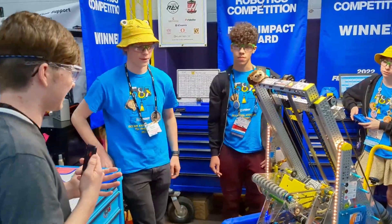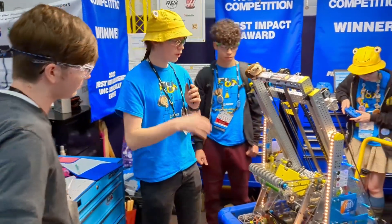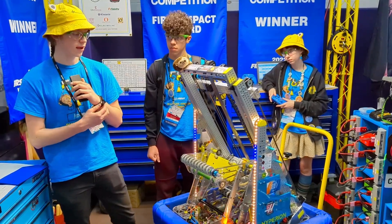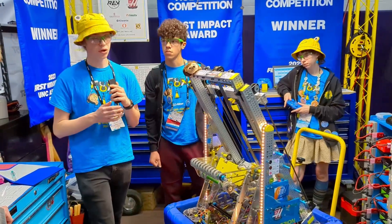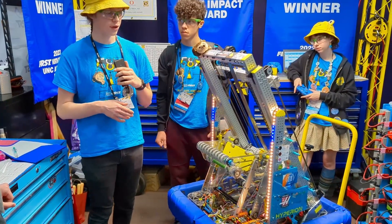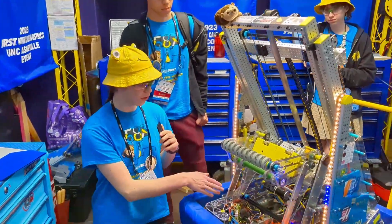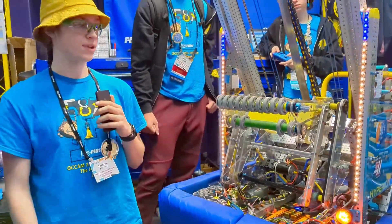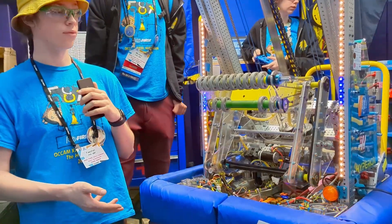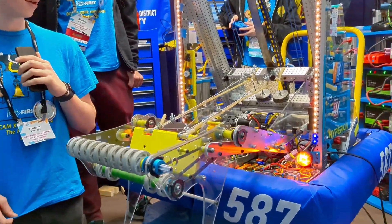It's really cool how you've built the redundancy in. Are those 3D-printed gears, and what powers this? We went this year with 3D-printed helical gears for our intake. We originally had aluminum gears, but we switched to helical ones for weight savings — and we could make them bigger while still saving weight, which increases contact and reduces slippage. They're also much easier to replace. Behind the intake is a bag motor mounted all the way at the very back of the intake, not on the extended section, so it won't be knocked off by another robot.